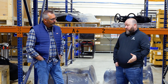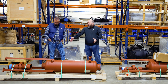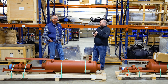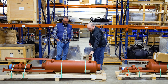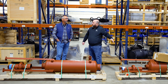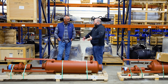A little bit about how these are designed and what options come with them. You can see we have a couple of them here — a small one over here and a bigger one right here. How do you know which one you really need? It's based off of the boiler design and operating pressure, and also how much blowdown is actually going to be running through it. The vessel normally works like this: the blowdown from the bottom of the boiler comes in through this fitting here. It treats it like a cyclone, which evaporates off the waste heat through a vent that goes out through the roof, and then the rest of the water gets drained out the bottom. So the vessel has to be sized for the adequate flow of whatever that blowdown is.